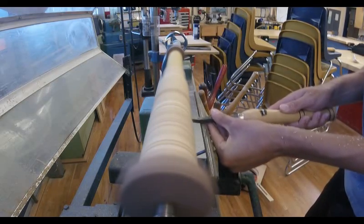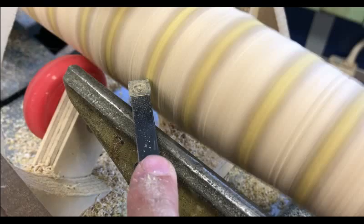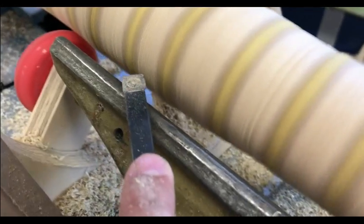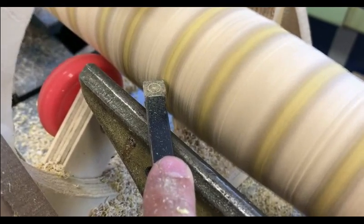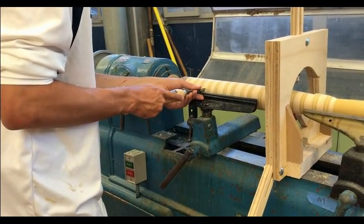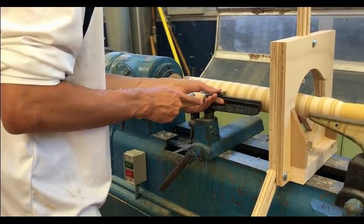With this turning I'm taking it very slow as there's quite a bit of chatter. To deal with that I'm using carbide tips because they're sharper and they can take smaller cuts. It's made of roller skate wheels and plywood, and it does a great job of stopping vibrations when you're turning. To be more efficient, I used two tool rests and two banjos throughout the turning so I wouldn't have to keep taking them on and off and moving the steady rest just to turn a different spot.